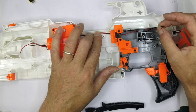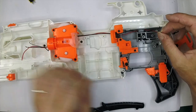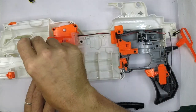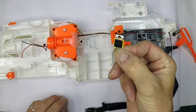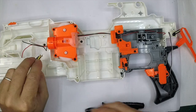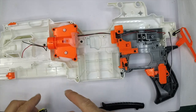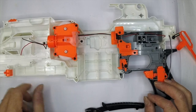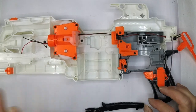That leaves you with your red and black front-to-back wires. The red one is going to be the feed to the main battery switch, and the black will be the return from the switch — so when you push the rev trigger, the black will carry the signal current through to the MOSFET. We're using the usual IRFZ44N N-channel MOSFET. We're also going to have a plug-in motor block and a plug for the LiPo, and a plug on the end of the battery tray. We're going to remove this lip here so that it allows us to drop the battery tray in and out — the grip covers that area completely.